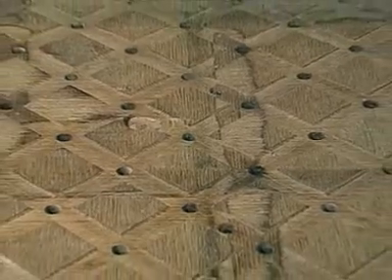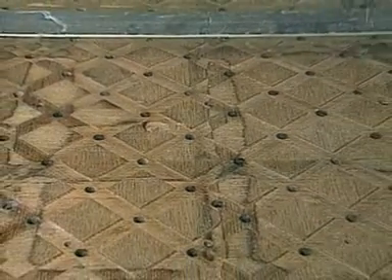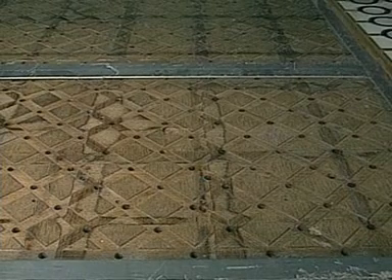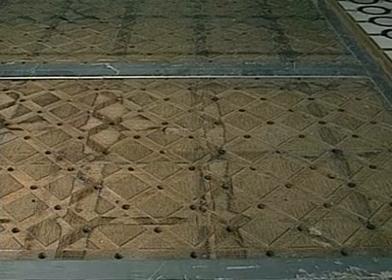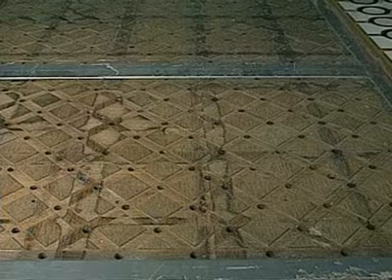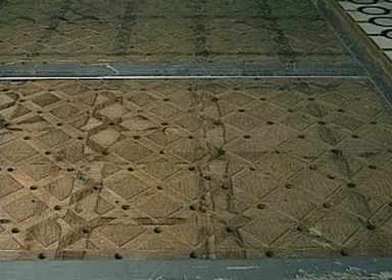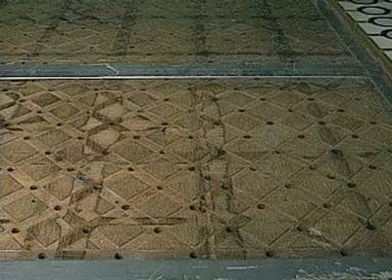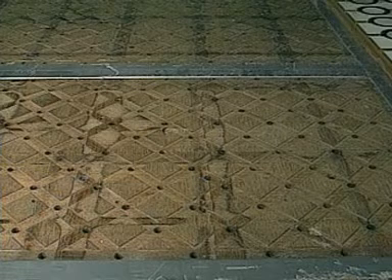For example, if particle board is used as the substrate material, it must have a sheet of high-pressure laminate — the kind usually applied to countertops — mounted on the top surface before the flip pod panel is put in place. Most routers have machine beds with air channels which can be matched to conform to the underside of the pod panel. For maximum accuracy, it is strongly suggested that the router itself be used to machine the top and bottom surface of the pod panel material.